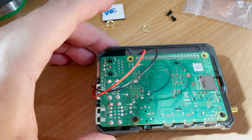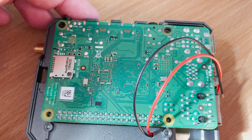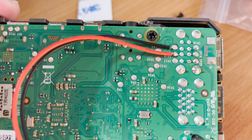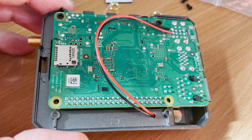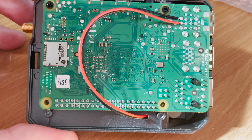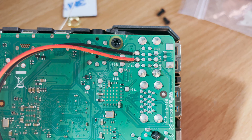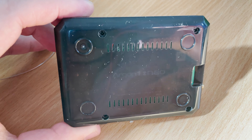With the Shari Pi Hat installed, we can take the black and red cable, plug one end into the white Molex connector on the Shari Pi Hat, and solder the other end onto two specific connections of one of the Pi 4's USB ports. The reason for the black and red cables between the Pi Hat and the Pi USB port is so that the sound card chip on the Pi Hat can be seen by the Pi — unfortunately it's not possible to get this connection through the Pi's GPIO pins.